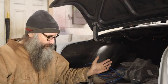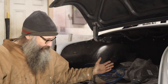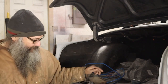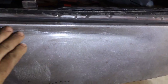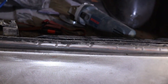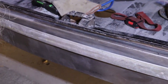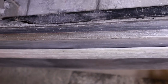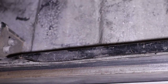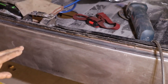We're back at the Rover today. I thought, just because everybody hates unispotters, I should do a video about using one — not because I like them either, but because in this particular case we have a crease. This is all boxed in, so we're gonna put a row of studs in here. There's our dent — looks like they got hit in the back and the bumper rolled ahead. Nice straight line, the damage is probably 18 inches. We put a straightedge tangent to our body and we can see we're in almost three quarters of an inch in the middle. Not a real life-ender, but definitely well outside of Bondo range, as we say.